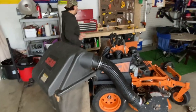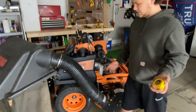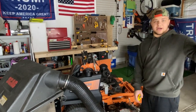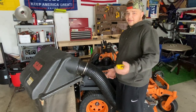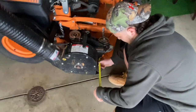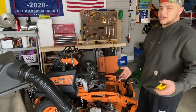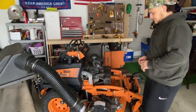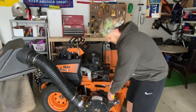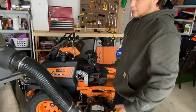One of the biggest questions I had — that I couldn't find anything about online — is how far this actually sticks out from the mower. For people going through gates and trailers, like my seven-foot-wide trailer, it's a big deal. Down here from the edge of the deck, the vacuum only sticks out about eight inches. This is a 48-inch deck; if you had a 52, you could still put it on a five-foot-wide trailer, but really tight. Anything bigger than that, you'd need a six-foot trailer. The fan itself is about six inches wide and adds about an inch and a half, so overall about seven and a half to eight inches on that side.